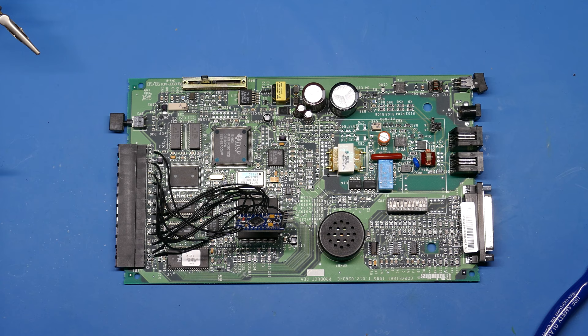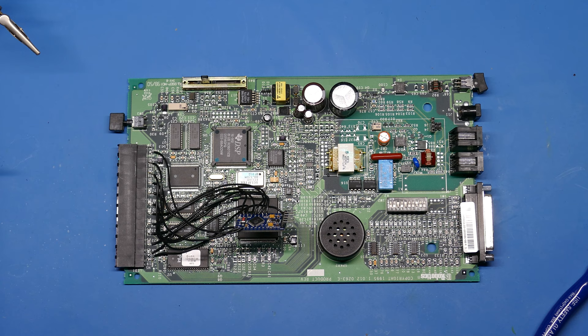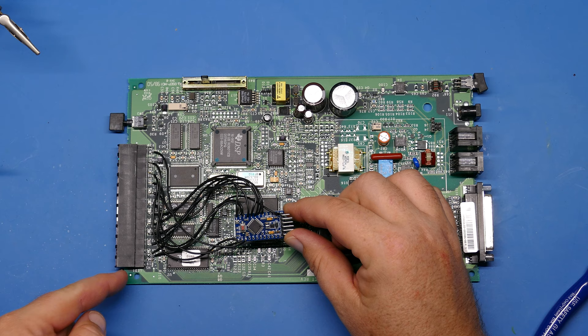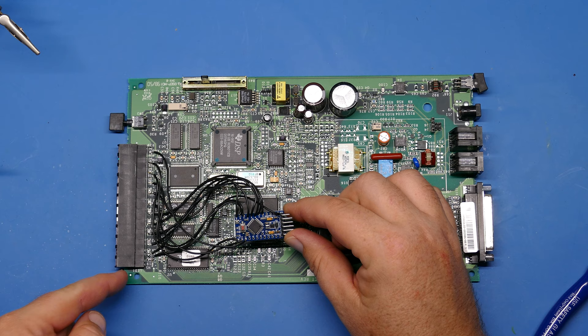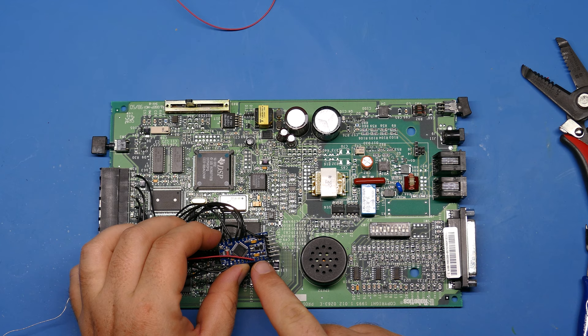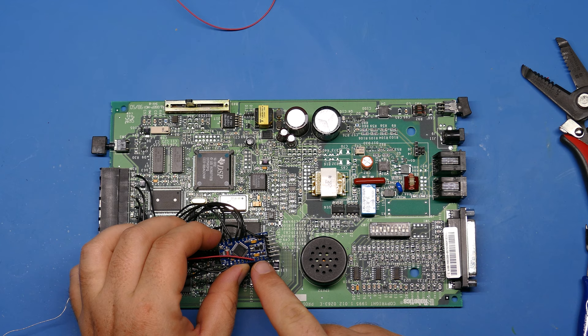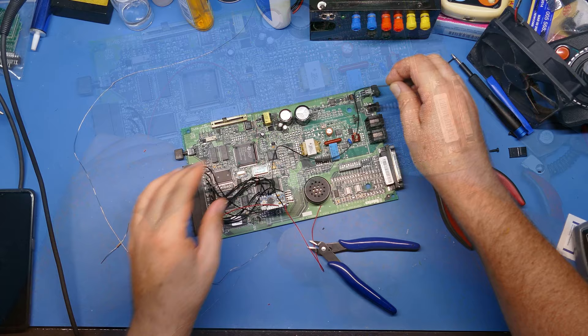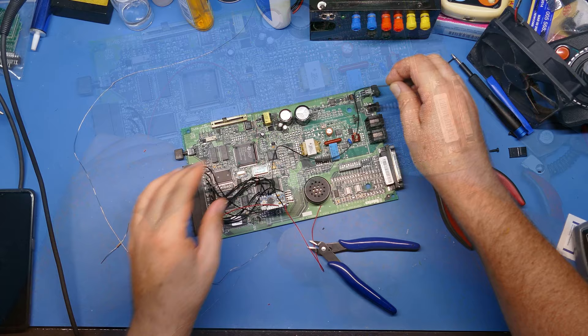All 12 wires are now connected to the LEDs. To test this, I need three volts connected to the three volt line connected to all the LEDs. I'm going to solder a wire from the VCC pin, put it through a hole, and connect it to the three volts on the bottom. I also need to supply voltage to the raw and ground inputs on the Pro Mini — one wire to raw and one to ground — hook that up to five volts and see if it works. Time for the moment of truth: hooking this up to my power supply.